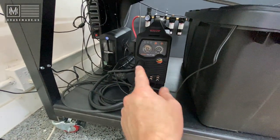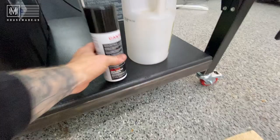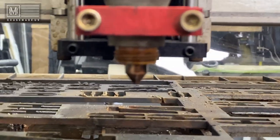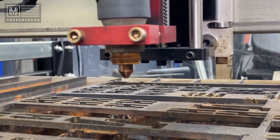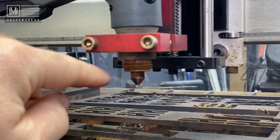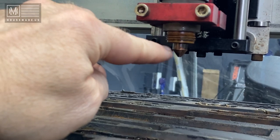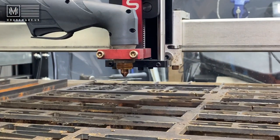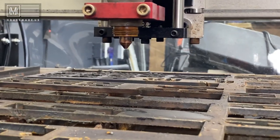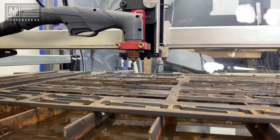After I adjusted the PSI, I moved all the electronics up onto the shelf where they belong, and I bought some anti-spatter for the nozzle. This nozzle here, which comes with the Razor Weld 45, it's not supposed to look like this — there's supposed to be a shield here. I didn't get the shield from Langmuir when they shipped it to me. I emailed their support and they're sending me one out. Unfortunately, I melted a little bit of this cup here. I found one on eBay that I'll be able to replace it with. I fried a couple of consumables because of it and melted the cup, but nothing that can't be replaced.